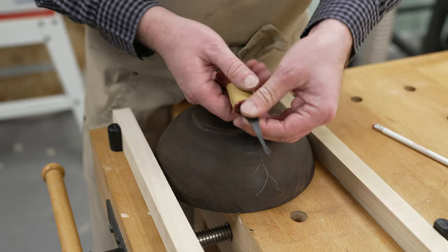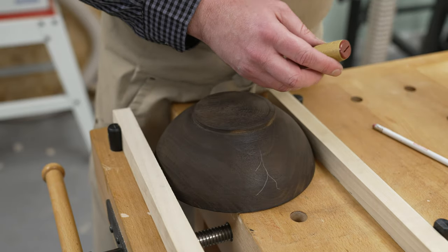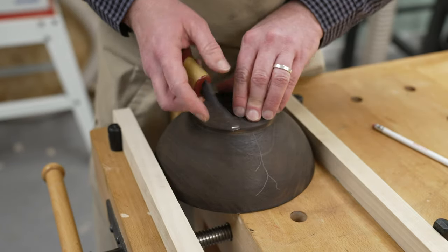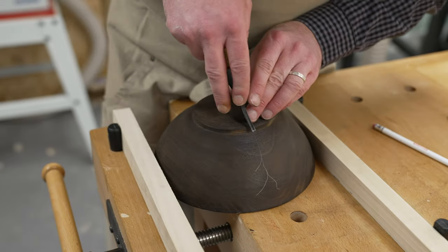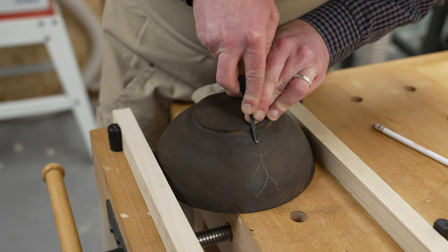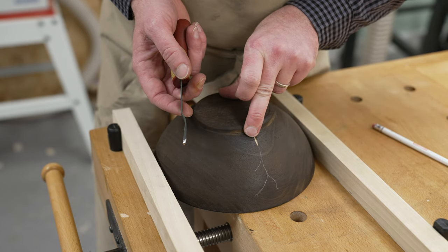Using one of these little FLEXCUT palm tools, that's got the V tool in a minute, which we'll come back to, but we're going with this one. This has got quite a tight sweep on this one, because we're going to start off with the trunk. Okay, so that little line is representing the trunk, and you'll see straight away if we start to come down that edge, that contrast that we get.